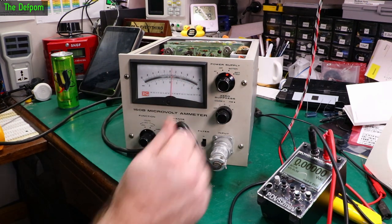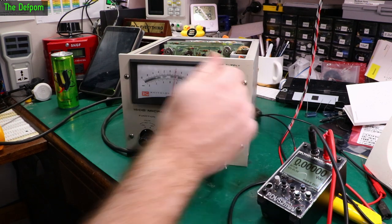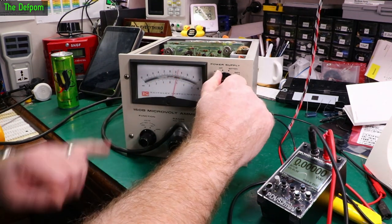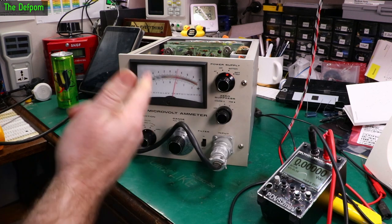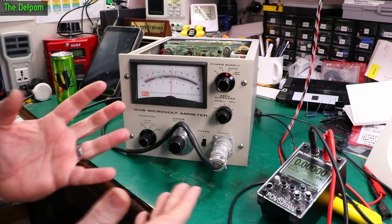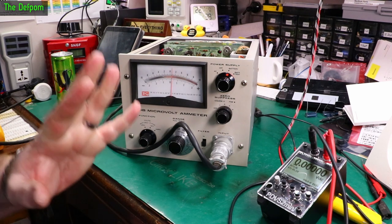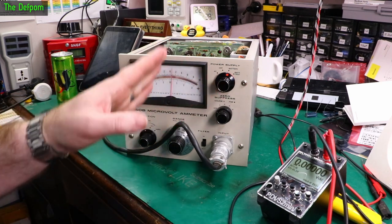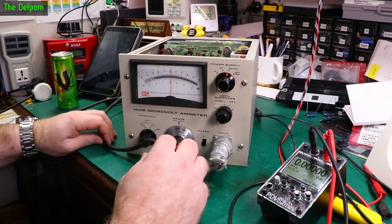So it's starting up, sorting itself out. Battery test. What does that say? Just over 6 volts. Excellent, that's right. So this scale, because you do the battery test, it can go up to 10. I was actually originally contemplating putting on a 9 volt battery instead of a 6 volt battery. 6 volts is what it originally came with. Circuitry could actually tolerate a 9 volt battery, and I was going to put a 9.6 volt battery in there, but it would have meant a charging voltage of about 11 volts, 11.2 I think it was, 1.4 volts per cell, which meant it would have gone off scale, which would have been a bit old. So that's why I ended up going back to the same as the original with a 6 volt battery. We're slightly to the right of the scale there.